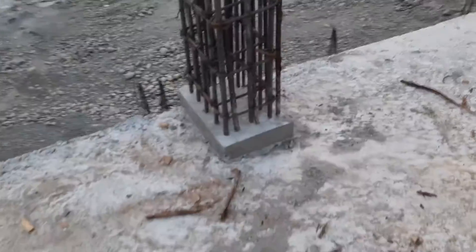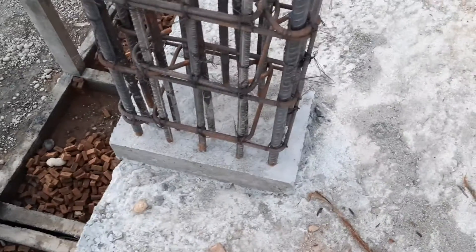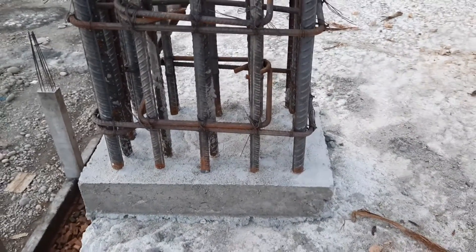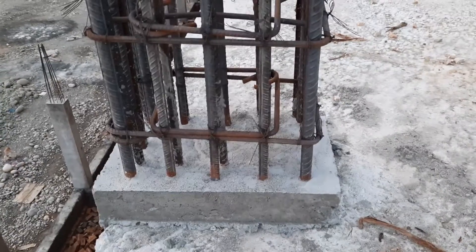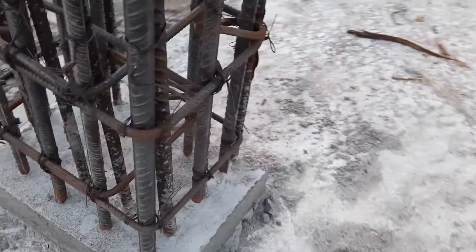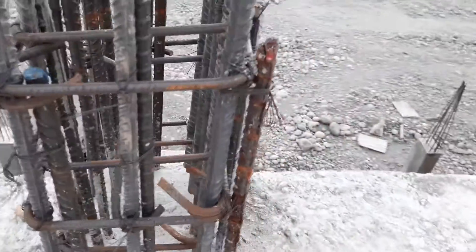You can see the steel reinforcement — they will overlap the other steel rods. The lapping is about 24 inches. This is one of the big mistakes, because this is not the place to provide the lapping.